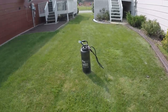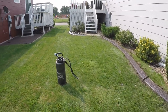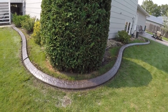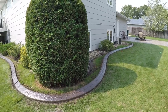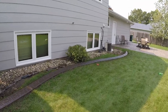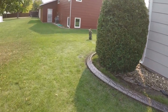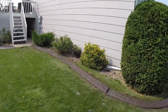This is after one coat. We use a 25% solids solvent-based acrylic — check your state for what they allow. It's 25% so it's technically considered a cure seal. You don't need to put it on heavy — just thin coats. If it starts to really run down on you, you're probably putting it on a little too thick. Thin to win. Put a thin coat on, let it sit for 10 minutes so it has some tackiness on top, and seal it again. Anything stamped for my company, we seal three times. We charge $3 extra a foot for colored and stamped, which doesn't take us much longer. I want to make sure they're getting the best product, and sealing it three times ensures it's nice and glossy. That's just being a good company owner and making sure your product looks good when you leave.